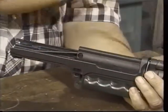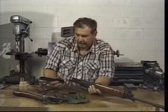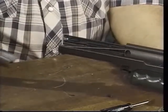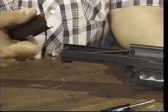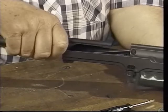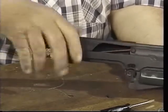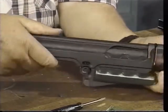Okay, your top cover, here again, we've got an inch top cover here with the tabs on the back. If it was metric, it wouldn't have the tabs. Easiest way to put it in is catch this side because the rail is longer. Catch this side, rotate it down, catch the other side on this side, and there again, it slides right on.